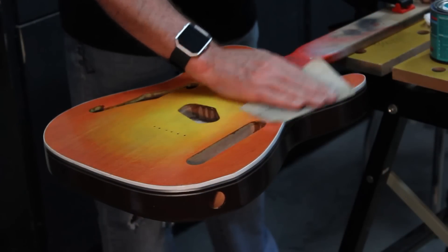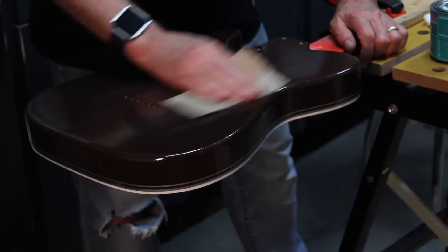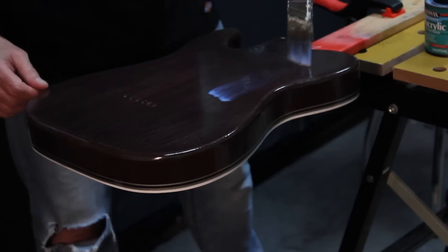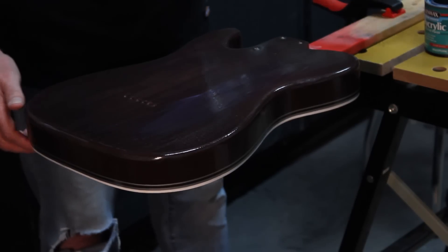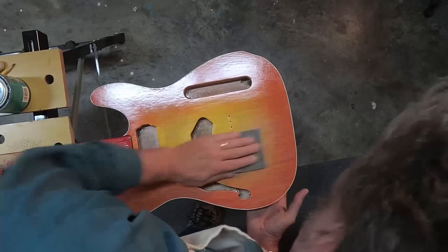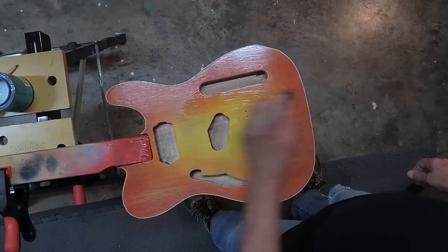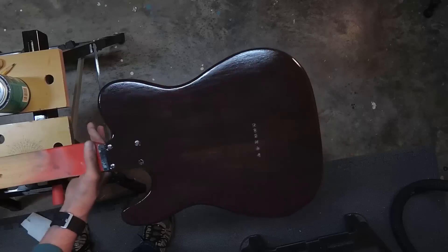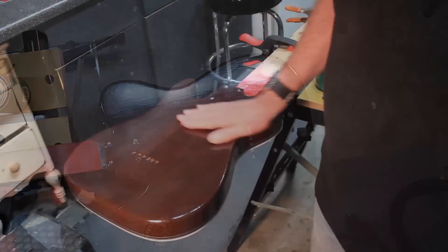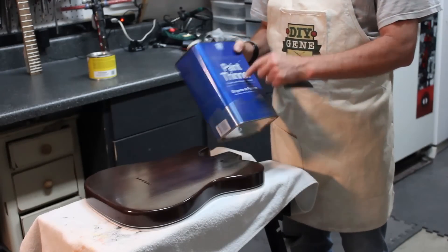Now I'm going to come back, give this a light sanding, wipe it down with a damp rag, flip it over, clamp it, and do the same. After it dried, it was much smoother, but I'm going to apply another coat. After letting that set up for about 10 minutes, I'll flip it over, give this side a light sanding, and do it again. Now this clear has been allowed to dry for about 24 hours. After about six coats, it's really pretty clear — I'm really surprised.